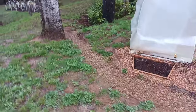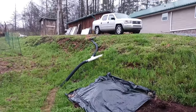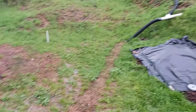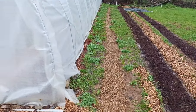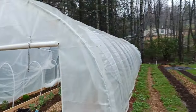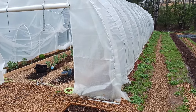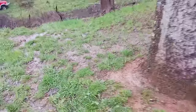Quick update if you didn't see the earlier video: this gravel trench here has two pipes. It's got the solid pipes that are capturing the roof water — you can see about half the roof and all of the shed — they all come together and run out this way. There's a pipe beside it; this is all French drain around the hoop house. The hoop house is about 700 square feet — it's 14 by 50.